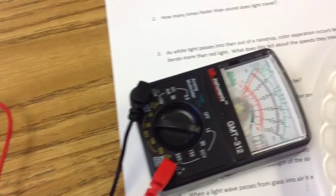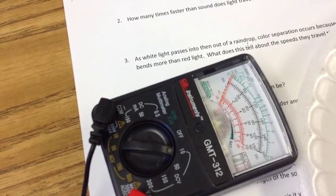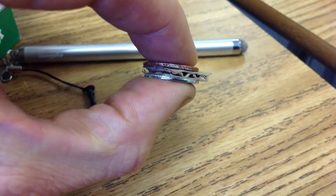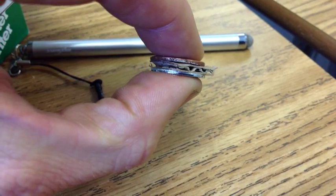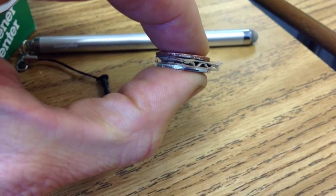Here I am placing them together. As we have it, that is a battery. Notice how it gets almost a volt — a little more than half a volt. So this right here is actually a battery. We have a penny and a washer with cardboard in between, and the cardboard is soaked in vinegar. That is the acidic electrolyte.